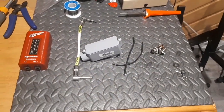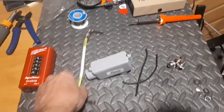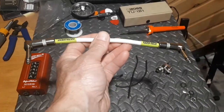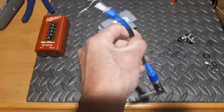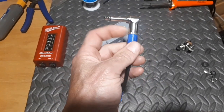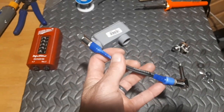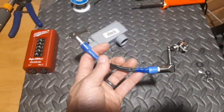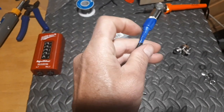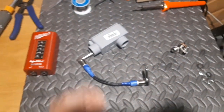That's the plan — might sound a little complicated but stick around. First thing to do is convert this cable, and by the magic of YouTube — abracadabra, there you go. I just took a piece of speaker wire, stripped these jacks off, got the original wire out, and now I have a nice short speaker wire. I taped it up at the bottom because the speaker wire is a lot smaller in diameter than the original wire, so there was extra space. This worked out great.